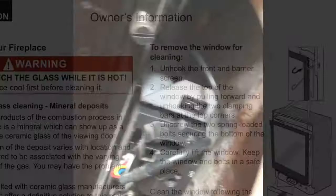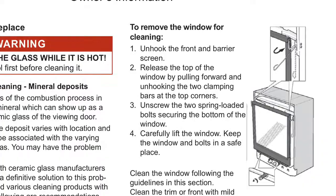Here is the valve assembly and the control unit. We need to get the glass front off so that we can do a manual lighting. There are just four things holding it on: two little screws on the bottom — lefty loosey to loosen — you can use a standard head screwdriver or just your fingers.